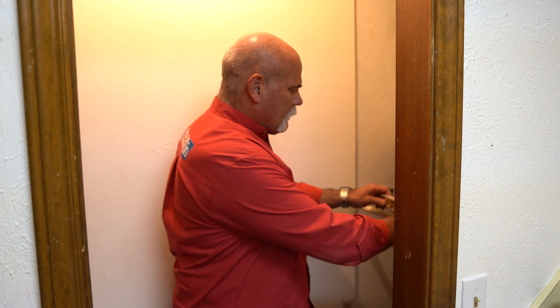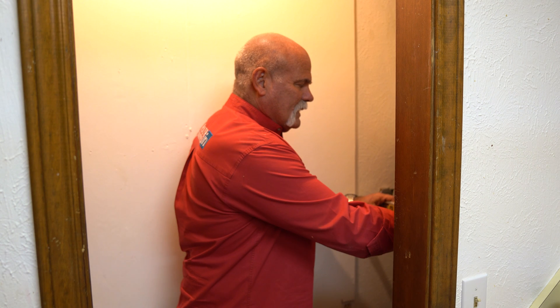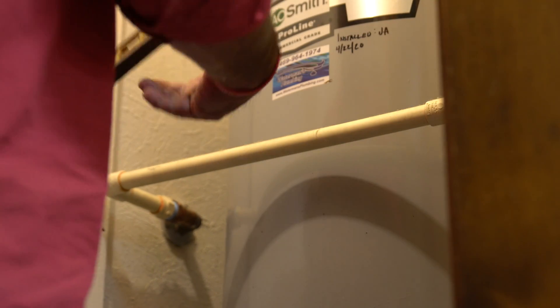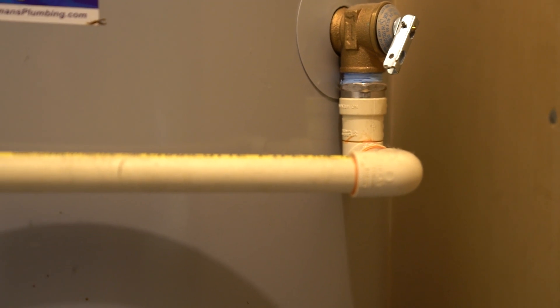A lot of y'all pointed out stuff like this before in other videos, so I'm going to let you know I am going to take care of that. One of the first things I saw walking up that I worried about is there's backfall here. They used plastic piping for the T&P, which out here there's no inspection — we're in unincorporated land. But one thing any plumbing company should know is this T&P is supposed to have fall on it. He could have tightened it up a little bit more, brought the T&P valve out the side, 90 down and across, and that way he wouldn't have had to shove everything in so tight. Putting it in the way they did, they weren't able to get fall between the T&P valve and the outlet out of the wall.